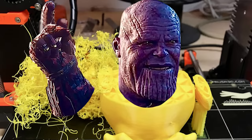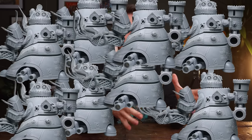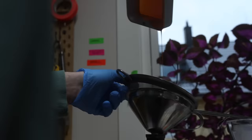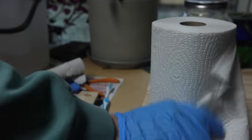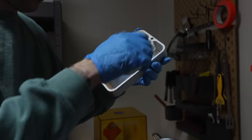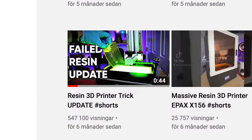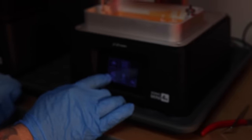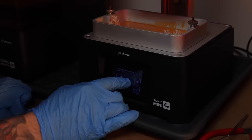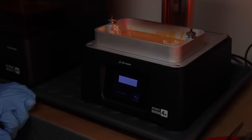Number one: cleaning the vat. You are inevitably going to get failed prints, and when you do you're going to mess up the next print too, because you'll have small particles inside the vat left over at the bottom. I hate emptying the vat, filtering it through filters to get all the stuff out, cleaning the FEP using IPA, and then scratching the FEP while cleaning it with IPA and tissues. But then Uncle Jesse made a video that flipped my world upside down. Pretty much all of the newer printers have a 'clean the vat' function.